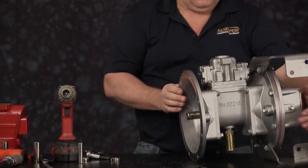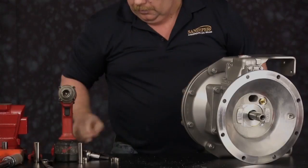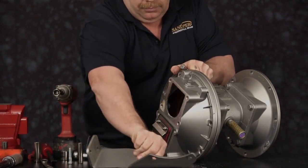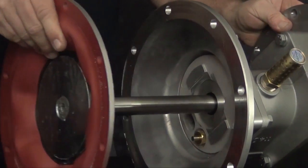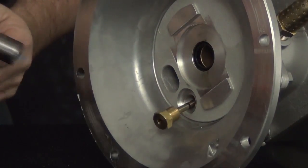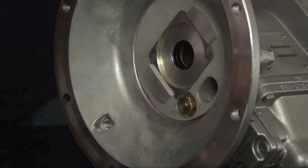We are ready to go to the opposite side to remove the opposite chamber. Remove the 2 top and 2 bottommost cap screws first, and then the 4 cap screws that hold the leg brackets on. We are ready to pull the diaphragm rod assembly from the intermediate section. We can remove our plunger pin bushings. Turn the intermediate around, remove the opposite plunger pin bushing assembly.